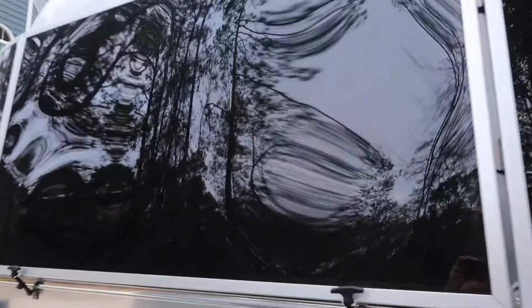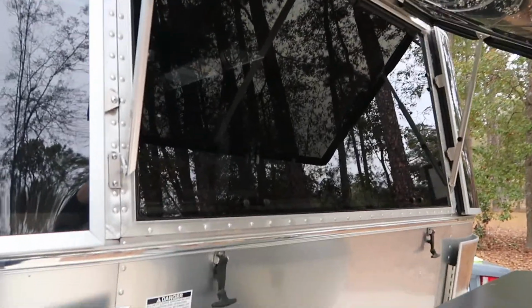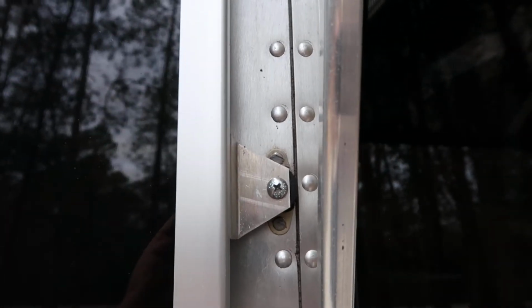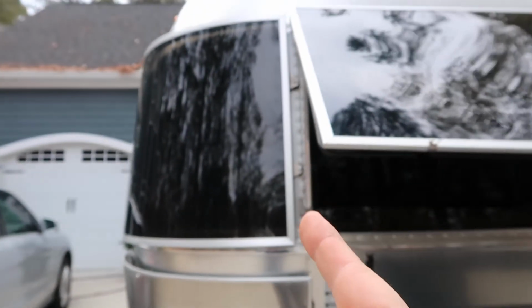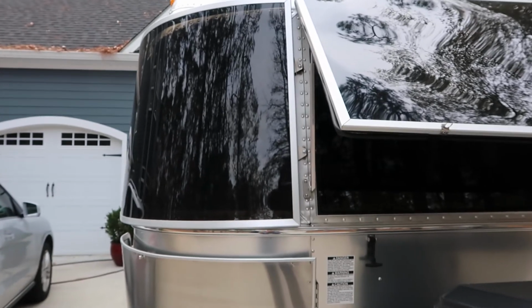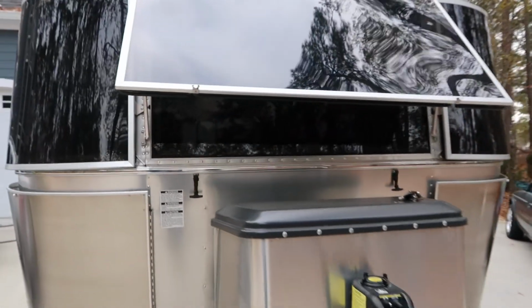The plastic outside windows can be opened to reveal the glass windows behind it. So you'd actually prop that up like that in order to open that window. And then you'll see behind these screws, they aren't threaded screws, they just turn a quarter of a turn. It's like a cam lock. One here and one here. And that allows you to swing out that whole corner window for cleaning. Sometimes they have a tendency for leaves to fall down behind them, and they need to be cleaned out periodically.